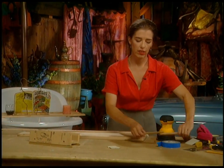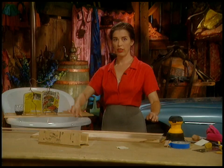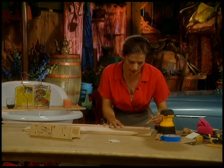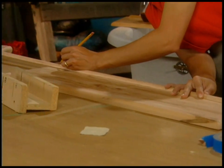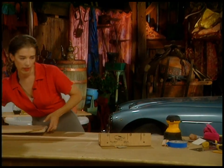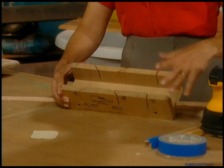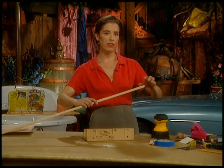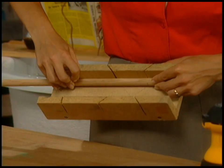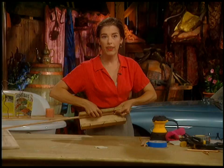I've already cut these two little bits that work as the rails that go underneath on one side, and I'm going to cut the top bit now that goes across the front to hold books and candles and everything in place. Then we'll cut through this to make the ergonomic wine glass pathway. I'm just eyeballing it right now and I'll center it up later. Get out your old miter box — all they do is give you 45-degree angles and a 90-degree angle to help you, because if you try to eyeball this and cut it on that angle, you'll just be frustrated. Line the mark up with the mark on the floor, because it's an angle, and it's hard to eyeball it properly unless you've lined that little mark up. That way you'll get the right angle with your saw.